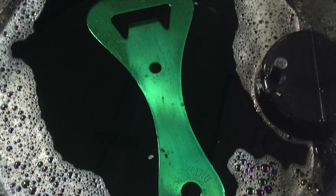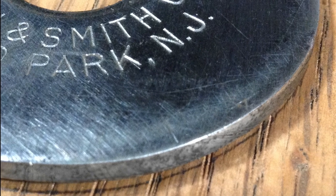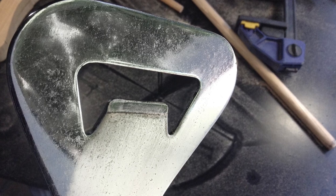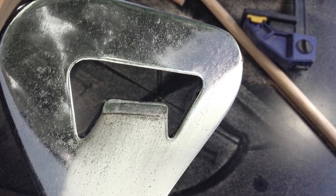It has some rust, but that's easily remedied with an acid bath — 30 minutes in phosphoric acid to remove the rust. And boom, rust is gone, but the pitting remains as evidence of age and mileage. It's full of character and it kind of looks like an old bicycle part. Every defect gets respect, right?